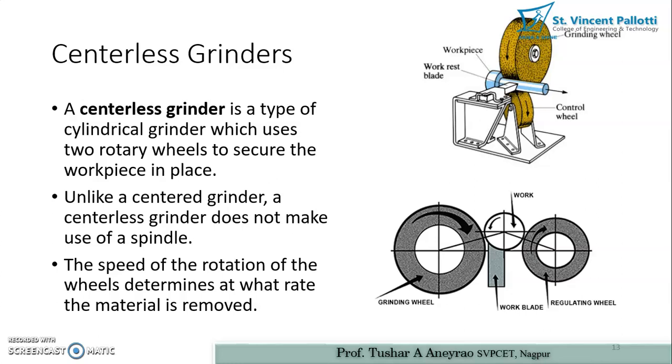This type of grinding operation is performed only for external or internal grinding of cylindrical parts. If you need to grind a cube, for example, it is not possible with a centerless grinder. What is required is a round work piece, which is mounted against two rotating grinding wheels. One wheel is driven by motor power and the other wheel has a stationary location.